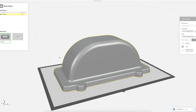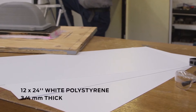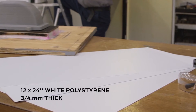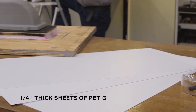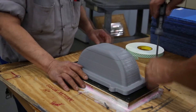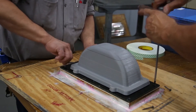If you find that over time your mold starts to deform, it should be replaced. For our vacuum forming plastic, we started with 12 by 24 inch sheets of white polystyrene approximately 0.75 millimeters thick, and then we worked up to quarter-inch thick sheets of PETG. Because we used an industrial vacuum forming machine, we also needed to secure our mold firmly to the fixture shown.